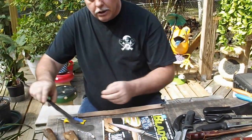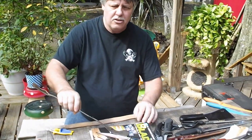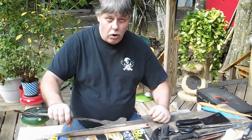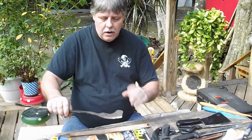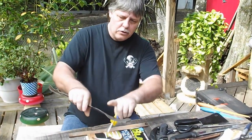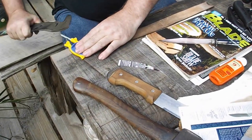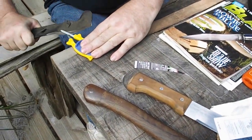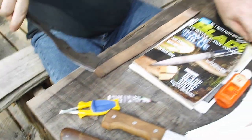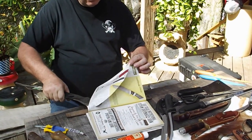I heard for many years, you've got to try it on a lawnmower blade, Paul. They work great on lawnmower blades. I thought my customers were nuts. There ain't no way it's going to sharpen a lawnmower blade. Well, I was wrong. These rods, the way they flex so they pick up any edge, I pulled my old lawnmower blade off and started running it through there. It took me about 5 minutes, and I got it sharp as a knife.